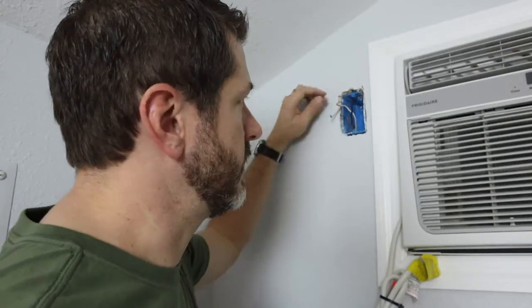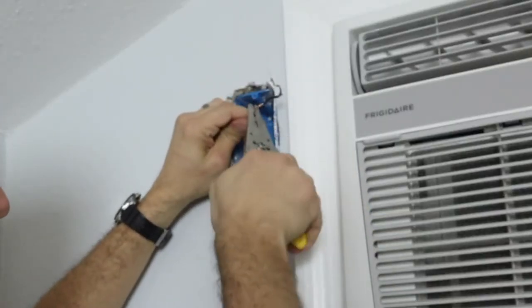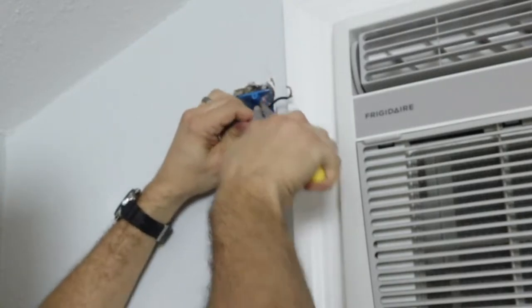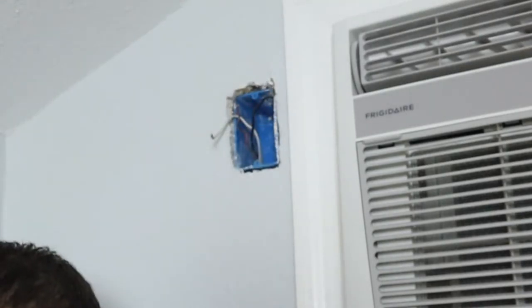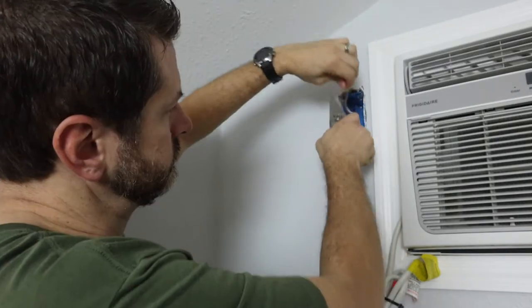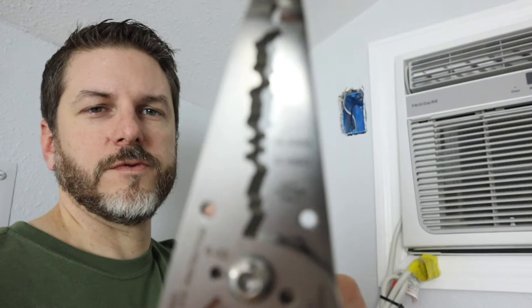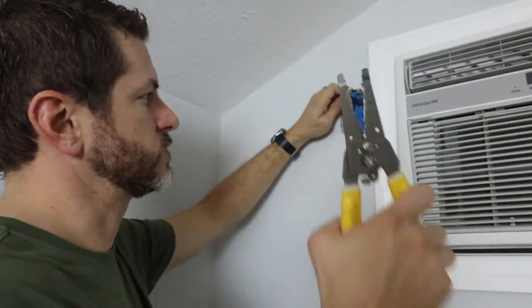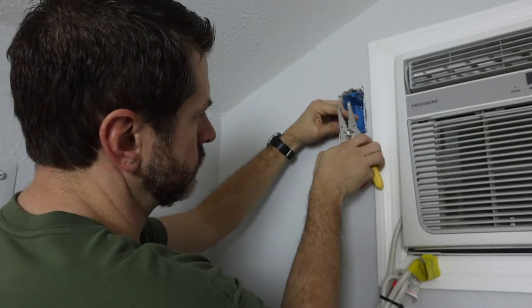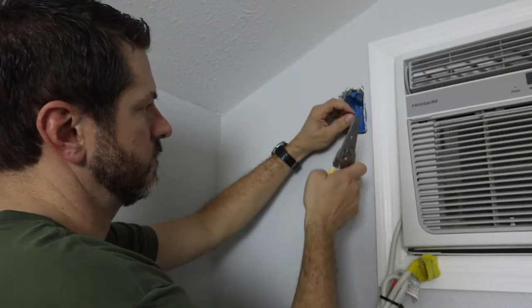What I'm going to do is go ahead and straighten out these wires. I can either straighten them out or just clip them off so that they're straight — I'm just going to clip this one off. I'm going to clip the hot wire. Again, make sure you turn the power off. These pliers have a stripper built in with the gauge that you need. This is 12 gauge wire so I can use those 12 gauge holes — just clip down and it pops right off.